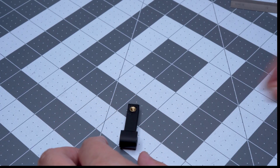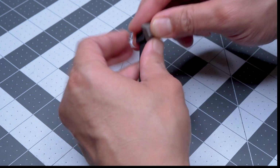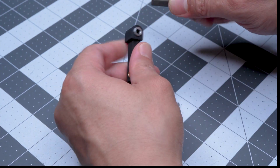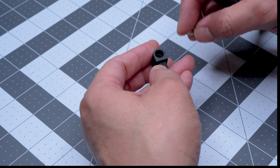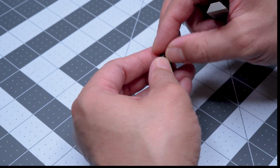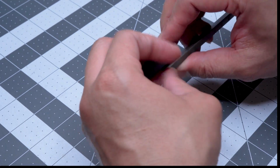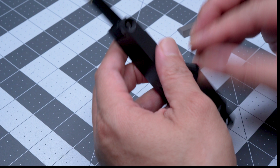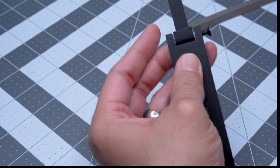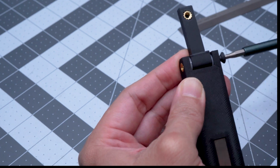The new hinge part has been designed to utilize aluminum spacers, which can be pressed in by hand. Though it still helps to use a sturdy flat tool and a clean flat surface to make sure they are properly seated. The spacers used here have a 4.1 mm internal diameter, a 7 mm outer diameter, and are 5 mm wide. In a pinch, spacers a bit shorter than 5 mm can probably be used, since the cavities are so snug.